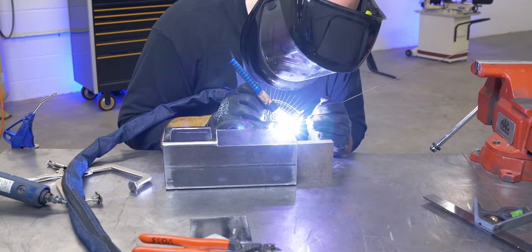When I actually start welding to the box, I have this chunk of aluminum. It's all dirty and nasty, but that doesn't matter. I have just had it laying around. And I'm gonna clamp it to the side. And then on the opposite side, clamp this, and that'll hopefully keep it square. And this will be a heat sink, and I'll move it around to wherever I'm welding. Won't work that well on the ends, but on these long sides, hopefully this will help.